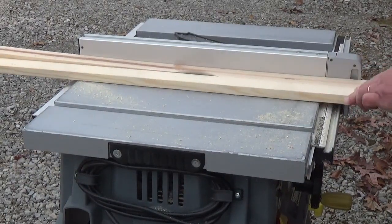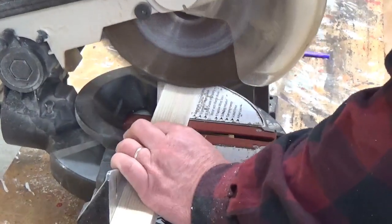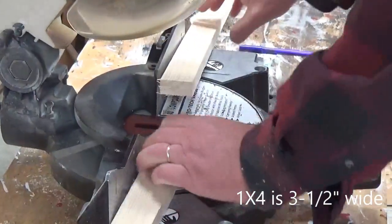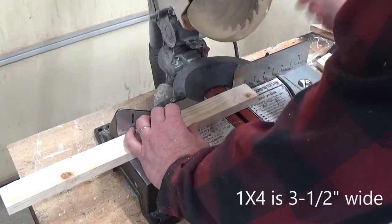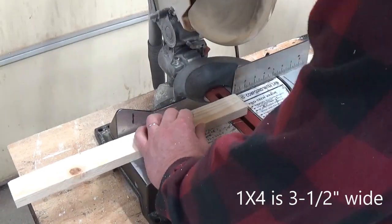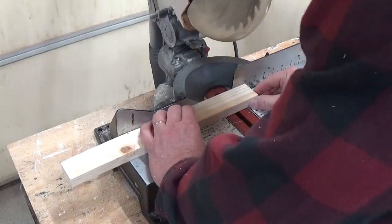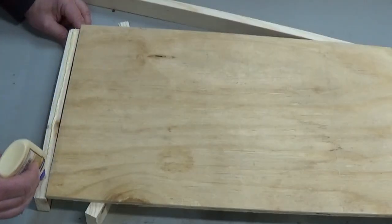I used a golf ball for the ball for the project, and I took a piece of 1x4 and ripped it right down the middle. That made it 1 3/4 inches thick, just perfect to let the ball roll on the inside. I chopped up the scraps to little pieces to help support the front piece. After all the holes were drilled, I figured it would be kind of flimsy.